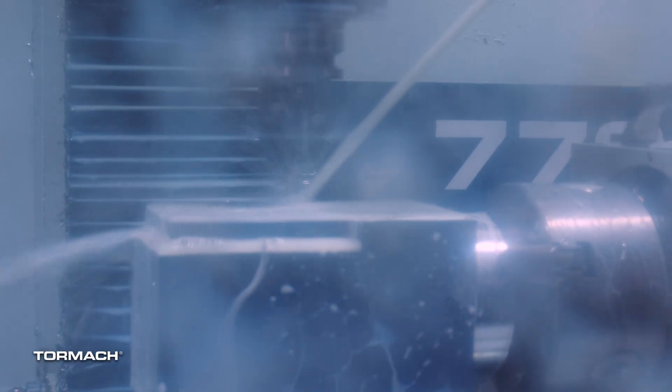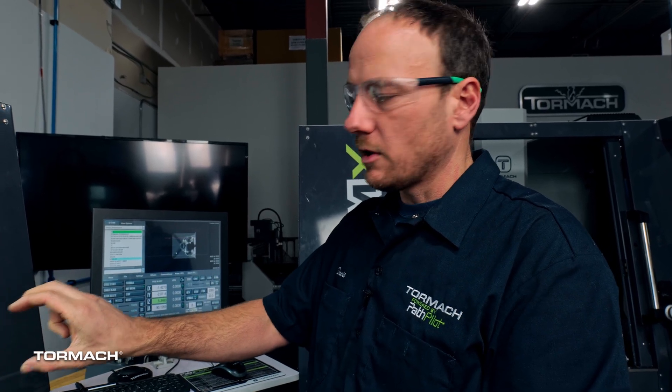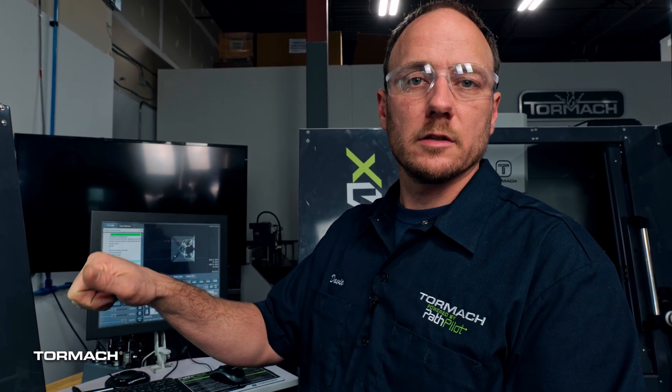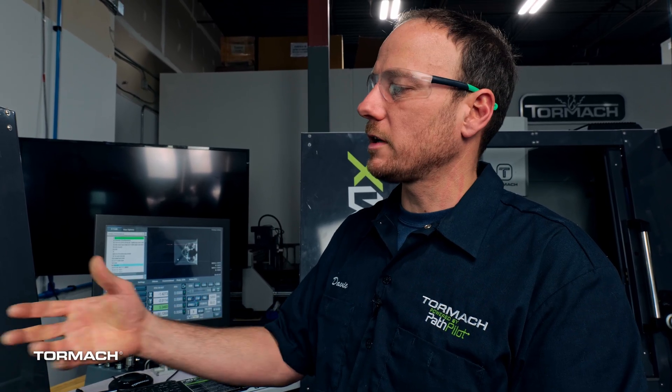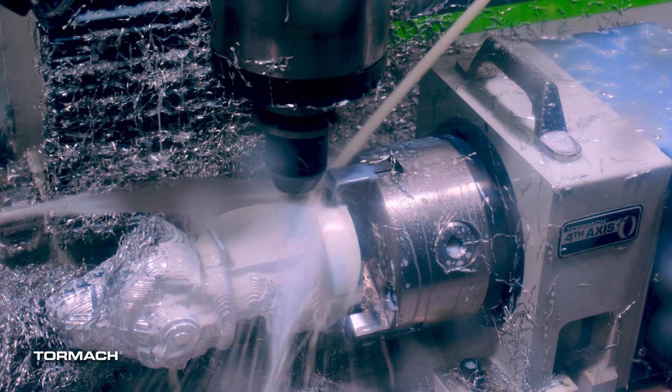One of the things I've learned through this project is that I wanted to remove material further away first, because if I cut his skinny little legs all the way down by the chuck, it creates a lot of chatter when the material is unsupported. So I'm starting out at the end, working the first couple inches, then the midsection, then the base, and hopping around a little with a smaller tool to remove bits of material for the ball end mill.